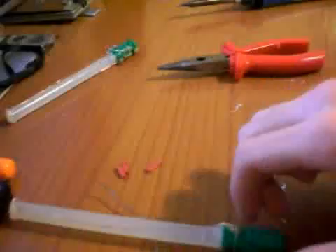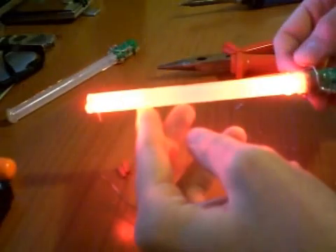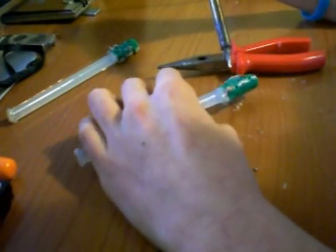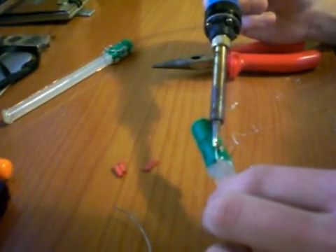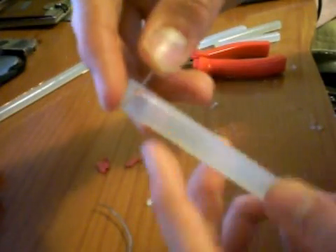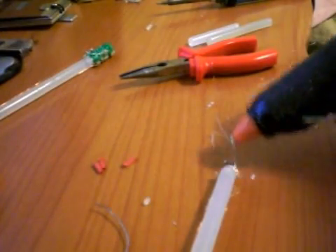Make some turns. We have nearly finished and as you can see it's fully functional now, but it needs some precaution against wires falling off. Take your soldering wire and solder the new wire to the old ones. Be careful, don't touch the battery. It's better here if we also use hot glue to cover the wires completely.